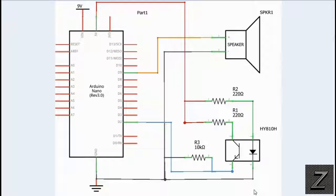If you want to use those magnetic sensors instead, get rid of the two resistors and the photo interrupter. Bring your voltage to one side of the magnetic sensor, the other side goes to digital pin 2. Still keep the pull-down resistor to avoid false readings from static. How the magnetic sensor works: when the door is closed, the magnet is right next to the sensor keeping it open like a relay. When you pull it away, it closes and allows current to flow, so the pin goes high.